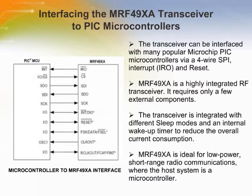In a radio link, the transmitter and the receiver are working on the same frequency. Only one device can transmit at a time and the other must receive. Once the transmission is done, they can change roles and send the data back, or send back an acknowledgement.